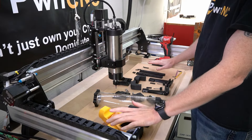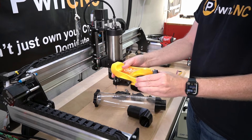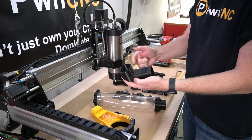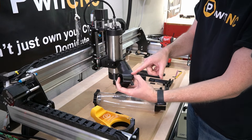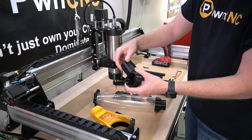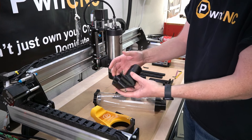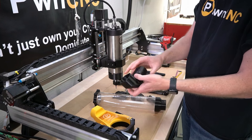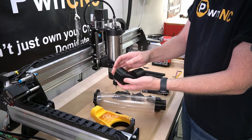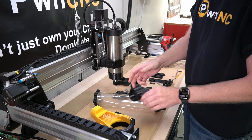What I've got here spread out is our entire tube bundle. I've already assembled our V3 dust boot. I've taken our extension adapter — basically the 90 degree portion, the small 1 inch extension, and the squared off adapter for the back of our boot. This is all that's needed for this particular setup. There may be a 2 inch as well as a 45 degree attachment in your baggie for the extension adapter — those will not be needed for this assembly. So you just need those three pieces.